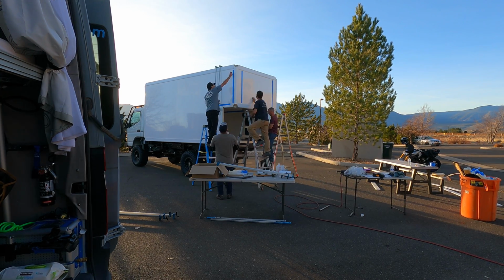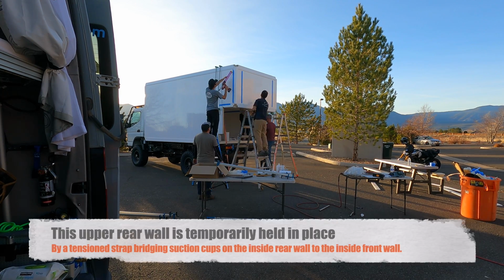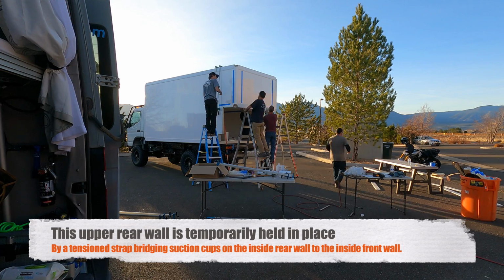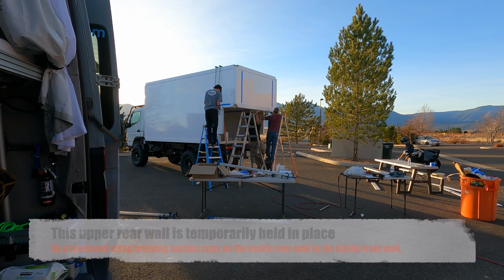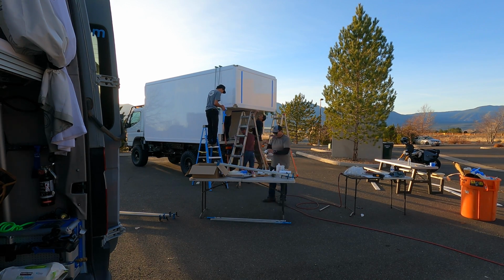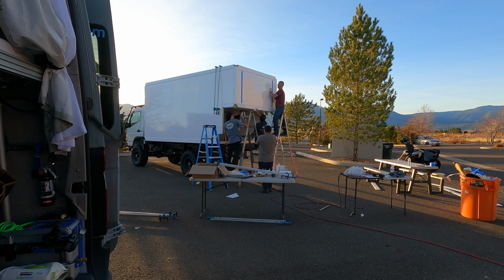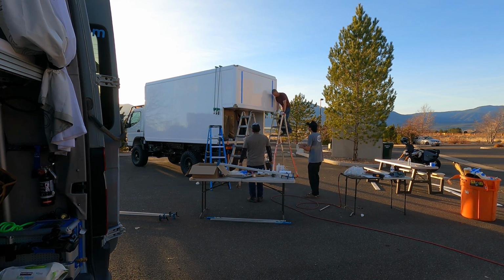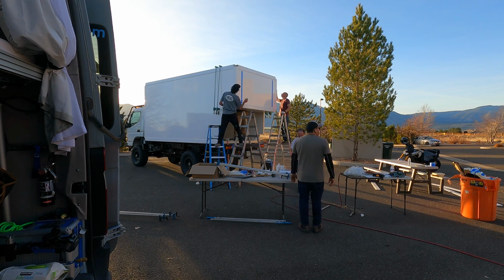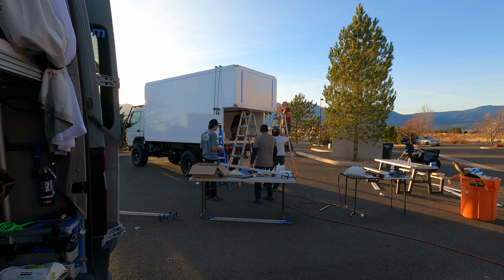All these sealant edges and the extrusions sealed up around their edges, things cleaned up from the sealant, and making sure that we don't leave any tape and so forth on that was there to catch that push-out residue. We also went ahead and left those blue tape stripes that go vertically up the rear wall on to mark where the structural supports are on the rear wall. Again, those tapes do not go into where the extrusions are because obviously we don't want to conflict with where the sealant is in those extrusions, but they are there to mark, so I know where to go and attach into those in the future.